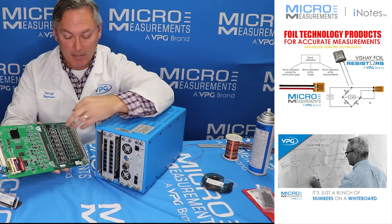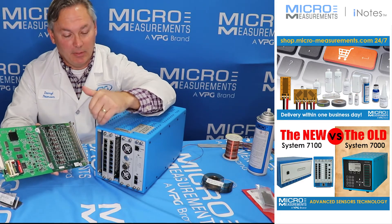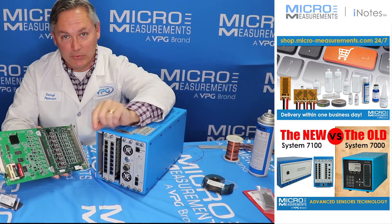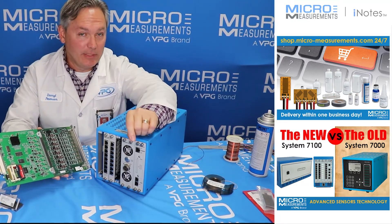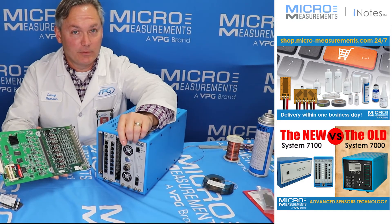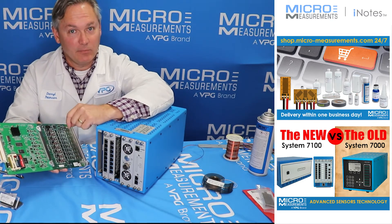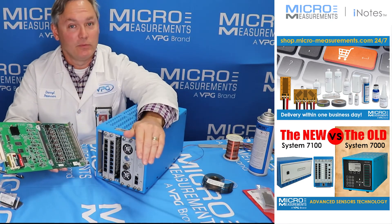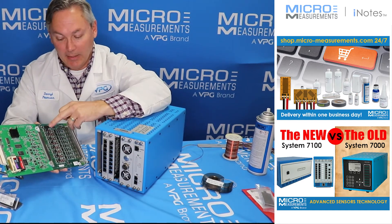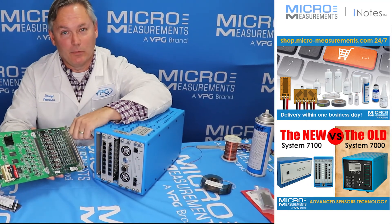You get to choose. By default, we typically simulate 10,000 microstrain whenever we're shunt calibrating with the System 7000. If you wanted to produce that same 10,000 microstrain shunt, you'd need a resistor that was 247,500 ohms. All you would do is pull out one of the tan resistors and replace it with that one — and now it's smooth sailing. You've got the same 10,000 microstrain simulation and a 5,000 ohm resistor to balance against your new 5,000 ohm input.